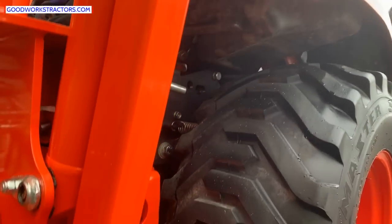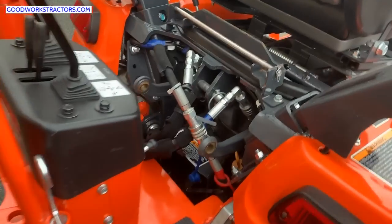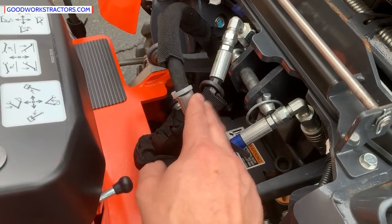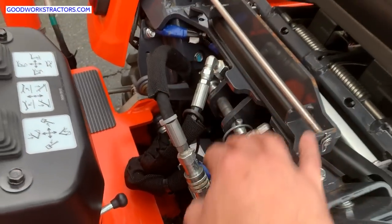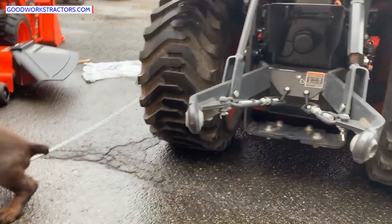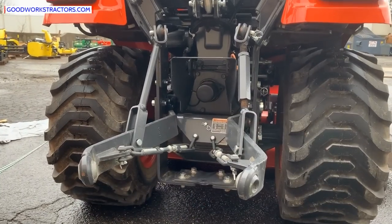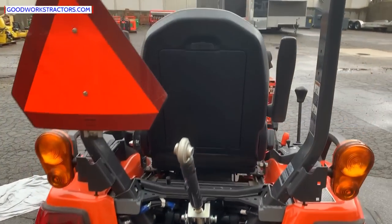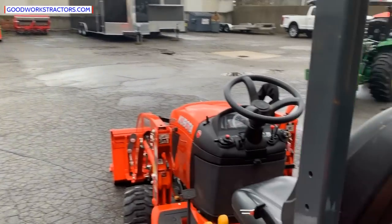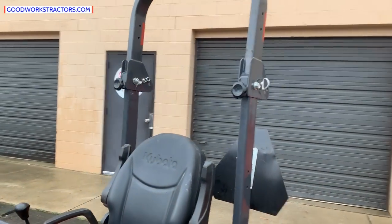The cylinders are cushioned on the Kubota. There are three hoses on the backhoe, and when fully disconnected you route this hose back into the machine to complete the hydraulic flow needed to operate your three-point hitch. Around the back you have your 540 RPM rear PTO and category one three-point hitch — all standard. Both units also have folding ROPS so you can fit it inside a seven-foot high garage with the ROPS folded down.